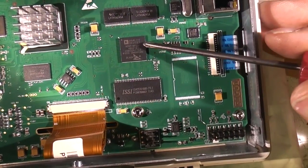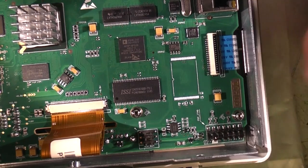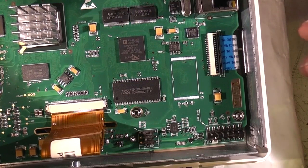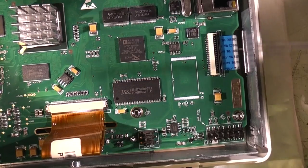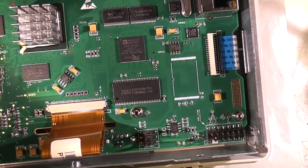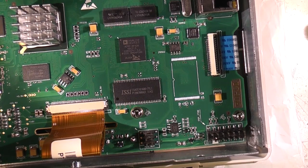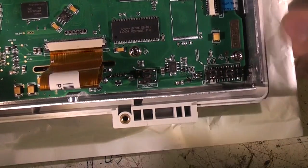This is the main processor — this is an Analog Devices Blackfin device, ADSP-BF526. So that's going to be providing the user interface, but also all the actual generation of all the waveforms in memory. It's interesting they use that rather than an FPGA with DSP on it. One reason for that is that FPGA silicon space is quite expensive, so a lot of manufacturers are moving away from integrating a soft core processor on the FPGA, and moving to put things like hard ARM cores instead.